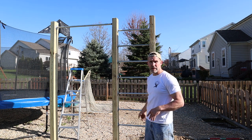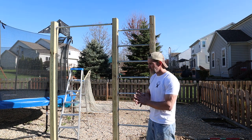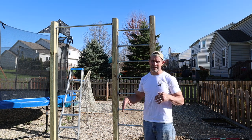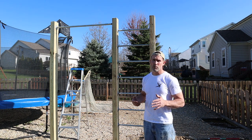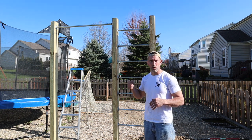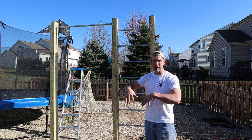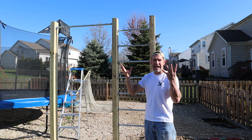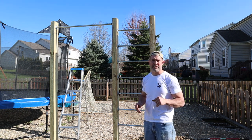The only thing left to do today is put some concrete in. I'm just using Quikrete — I think it takes about 40 minutes to set up. You basically just put the bag in and add water until it's good and wet; they say up to a full gallon. I'm going to poke some air holes down into the concrete so the water saturates it well. With concrete, as it hardens it pushes the excess water up and out, so if you over-water it a little bit it's not a big deal — it's still going to set up really hard.